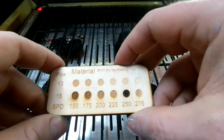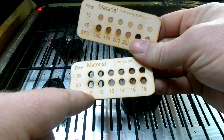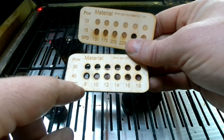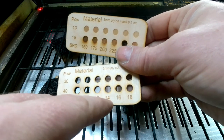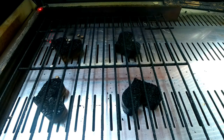So let's go back to Lightburn — I'm going to change these settings. I'm going to start at 18mm per second and increase in 2mm per second intervals going across: 18, 20, 22, 24, 26, 28. So let's see how that cuts.